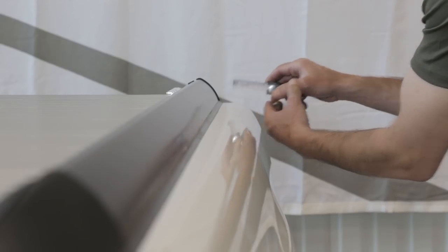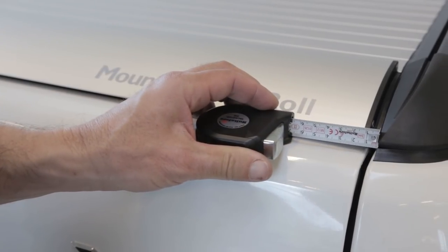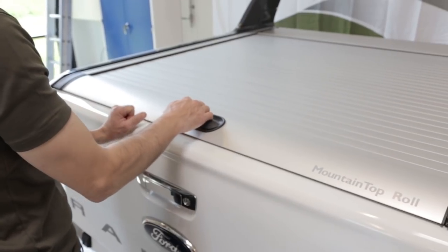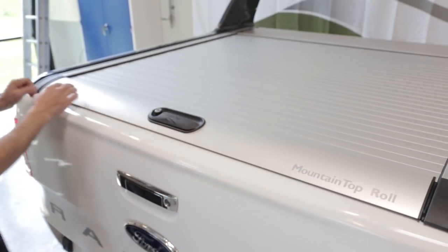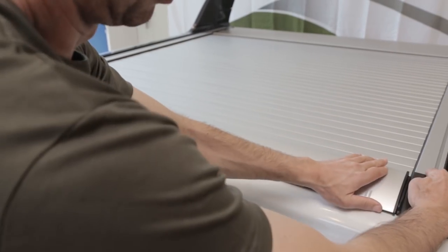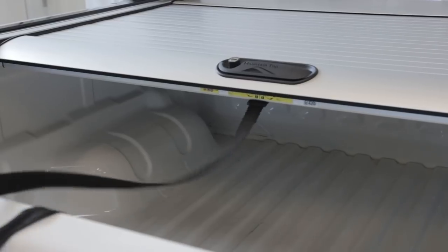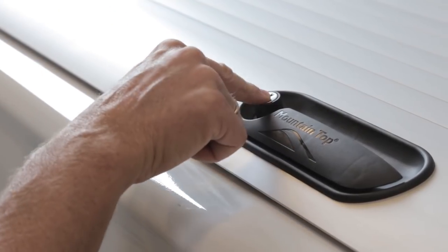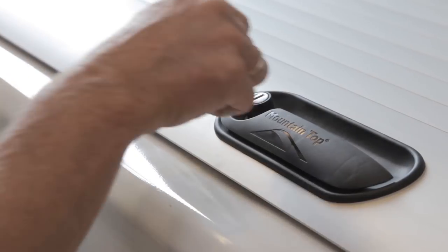Check equal width at front and rear. Check that lid rolls freely back and forth. Use pull strap. Check grip and functional space of locking pins on both sides — 0.52 mm. Check intermediate positions. Check locking function: vertical keyhole.